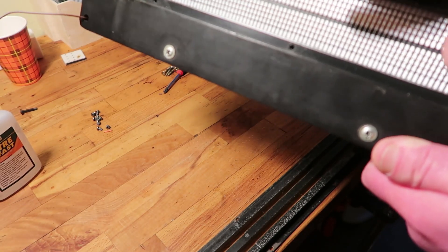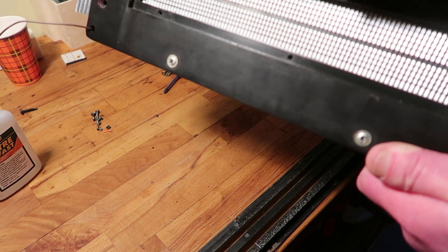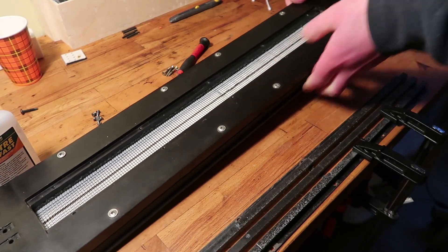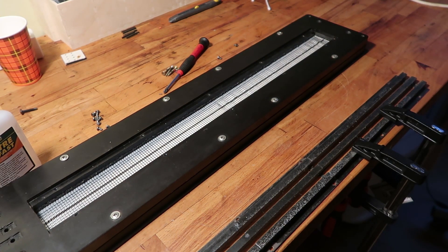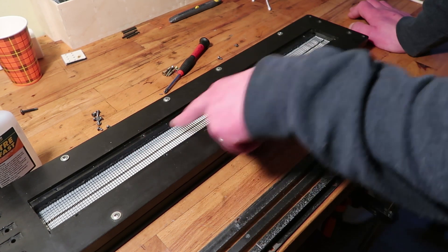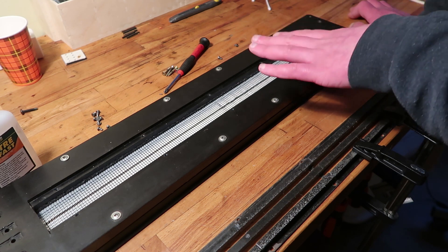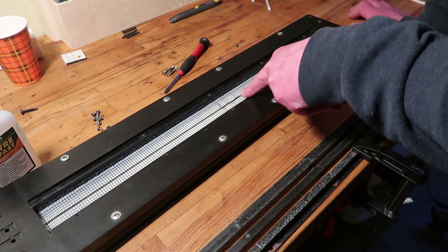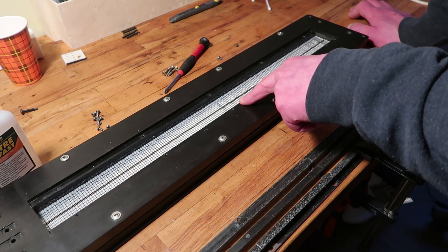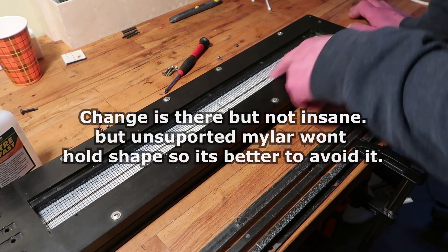There's now a large piece supported by foam that doesn't do much — but could you make that a bit smaller and the membrane itself wider? That's something I'd try for my own design, not this one. You see a lot of traces, but only the outer traces are not current-driven — they're just there to hold shape. Losing shape, like I did by putting magnets in there, will result in all kinds of distortion.